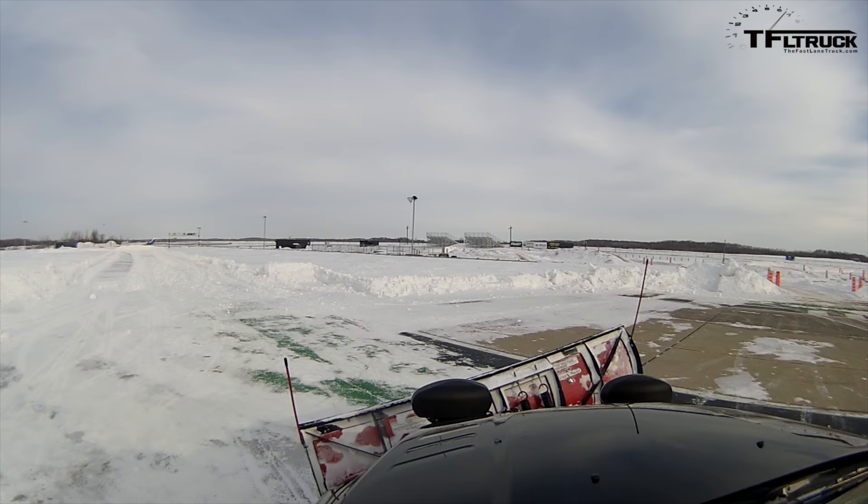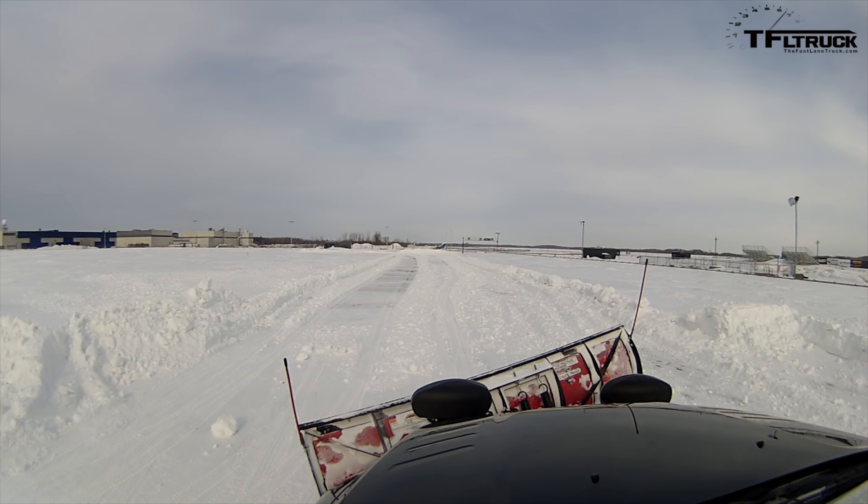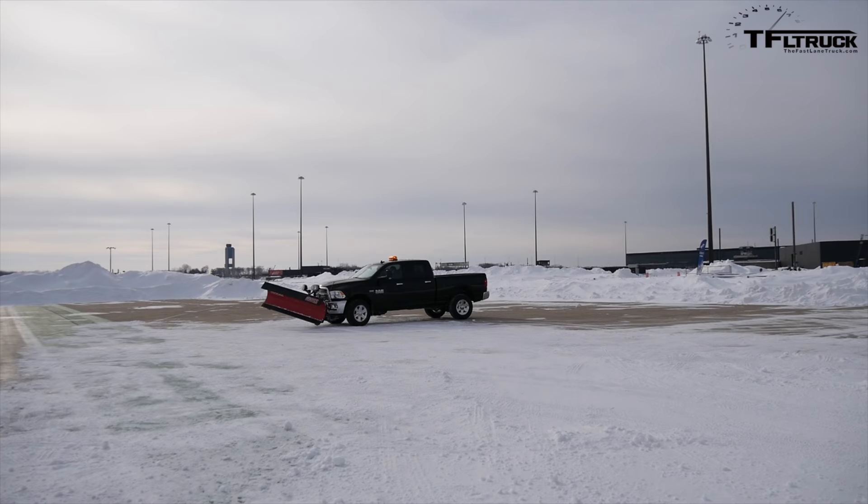Now you're lining up and figuring out what cut you're going to make. You've got to pay attention to the type of material you're moving — whether it's thick wet snow, fluffy snow, or hard frozen snow like this. We're in negative 20 to negative 30 degree weather. These snowballs are not light and fluffy; they don't break easily. You've got to keep that in mind because the truck and blade can only push so much material at one time.